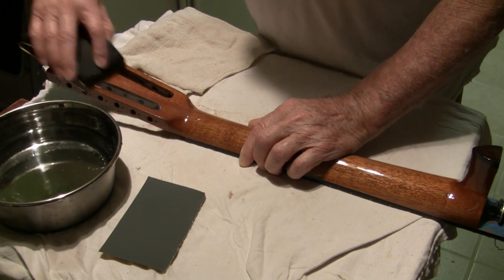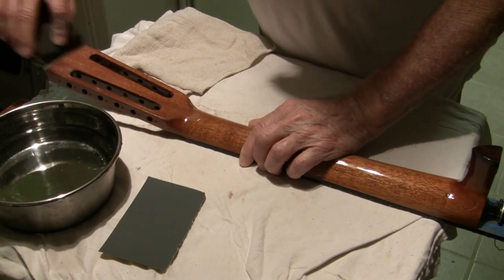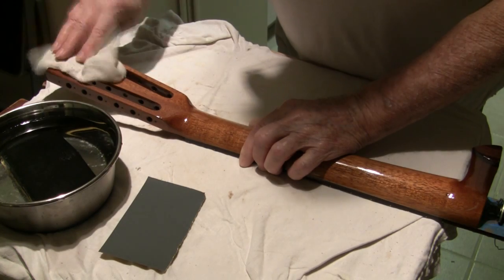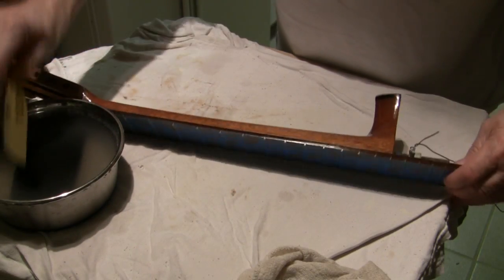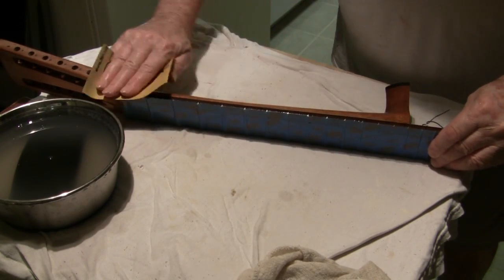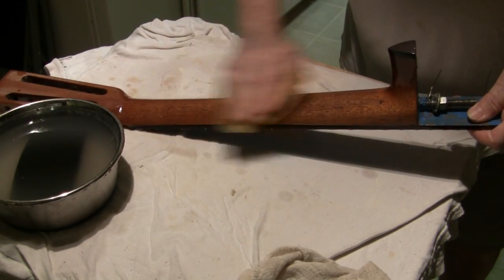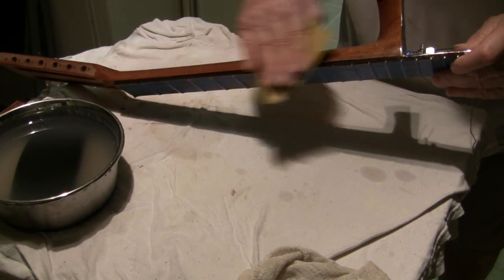With no little shiny spots on it, which would mean that there are low spots still that haven't been filled yet. I sand a little, and I wipe it so that I can see it dry. And I see little dimples all over in here where I haven't sanded down to the flat surface yet, and I just keep doing this. All the rounded and contoured parts are all done freehand, and as with so much of this, it's all purely by feel.